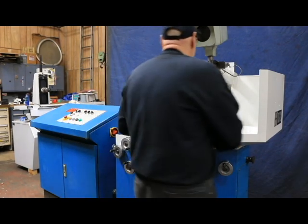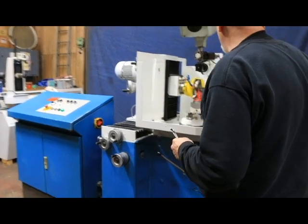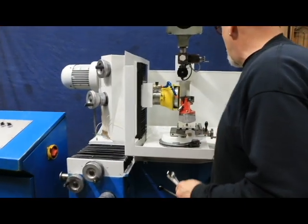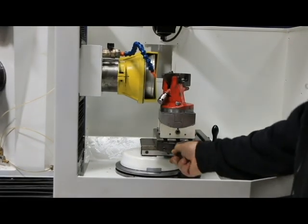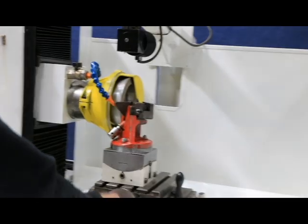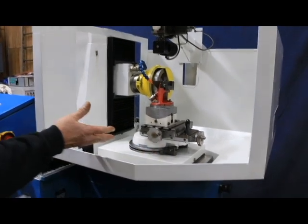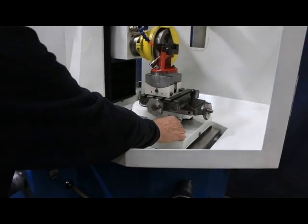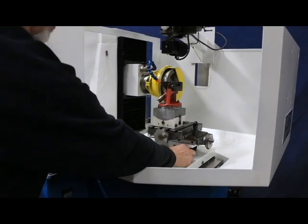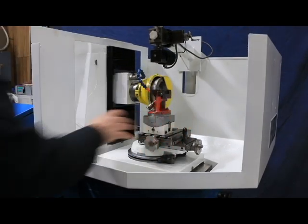So you've got your cover here. This has an outside guard that can rotate around. This is your water for the coolant. And then you've got these compound slides here that go in and out — this one's locked. It goes all the way back. And then the bottom here, you can set it on zero, or you've got these stops here and you can slowly move them out with the fine adjustable screws, or you can move the stop all the way out and swivel this in certain applications.